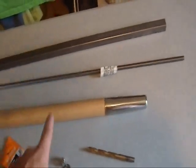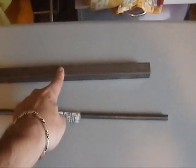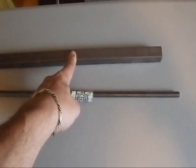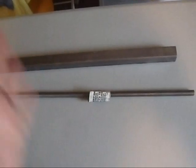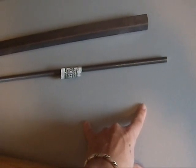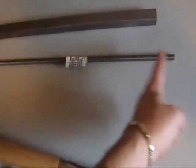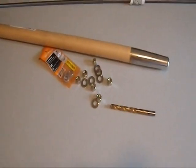So I'm going to need to drill this out and then cut it up. I'll need a seven-inch piece of the square stock. The best way to cut it and get the control I want is probably going to be by hand, which is going to be rough — I don't have a cut-off saw designed for this, and my saw creates so much vibration there's no way to get a clean cut. There will be three cuts in the rod and only one cut in the tubing. I need to figure out how long the threaded rod needs to be to account for nuts and bolts on either side, so it sits six inches above the cross piece. At the end I'll have extra rod and extra tubing, but I'm sure I'll find something to use those for in future projects. We're at stage one — let's see how it goes.